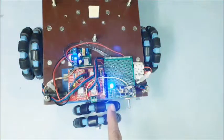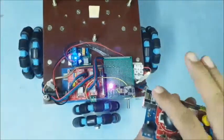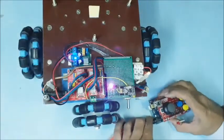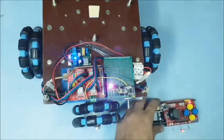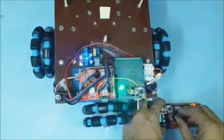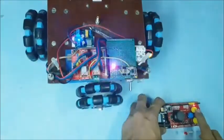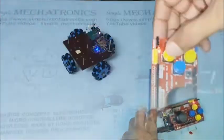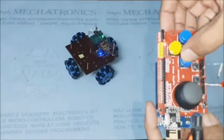Now switch on the power supply — the RGB LED blinks for a while waiting for self-test. Now the Omni-Robo is ready to receive commands. Here a 9-volt battery is used as power supply for the transmitter module. The Omni-Robo is tested for movements controlled by the joystick in all directions including clockwise and counter-clockwise rotation. The control may be tested within a 2-meter range, and the range may be improved by adjusting the source code. More current is required for the nRF24L01 for greater distance of control.